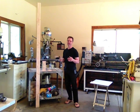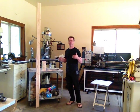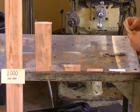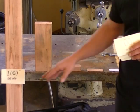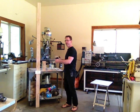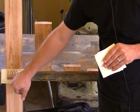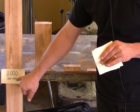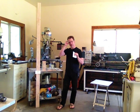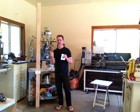It's amazing what we do as machinists with the materials we have. When we're working in the machine world, we're dealing with decimals — breaking things down into tenths. If you were to get a blueprint as a machinist, it would say 1.000. What is significant: anything to the left of the decimal point is in full-size inches; anything to the right is breaking that number down. Those three zeros behind the decimal — don't ignore them. The engineer wants that part made to one inch with accuracy within a thousandth of that inch.